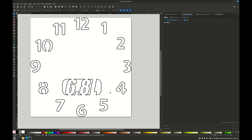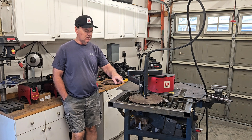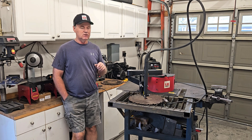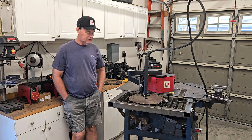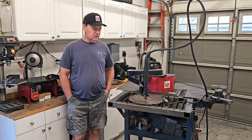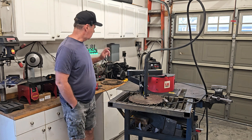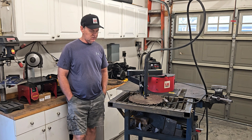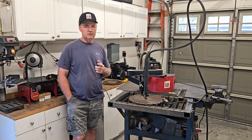As you can see, while you were away I got everything set up. I've got a blade loaded up and the drawing loaded in SheetCam. I use my settings for 16 gauge, but these are heavier - somewhere between 16 and 10 gauge, maybe 14. So I adjusted the speed down to 100 inches per minute and cranked up to 35 amps on the plasma cutter. That should accomplish the cut. Let's get it fired up and see what happens.